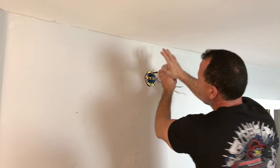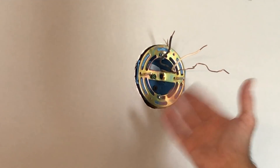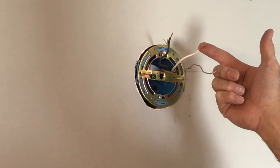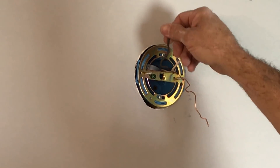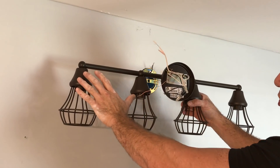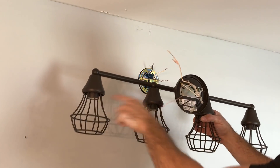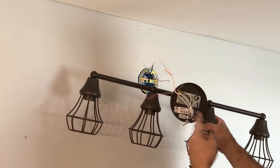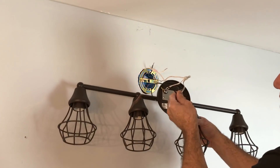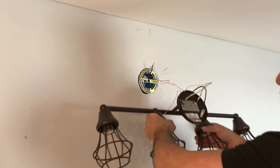Great thing about this screwdriver is I can hold that end and just run it in fast. This is super simple — you only have three wires to mess with. This is a single-pole switch, so you have a neutral which is white, you have a hot which is where your power comes from — that's black — and then you have a ground. Your fixture itself is made the same way: each one has a black wire and a white wire hooked to them, and they're all connected into a little harness. Your white has a little pigtail that goes on the white, and your black has a pigtail that goes on the black. And of course you have your ground, which is the bare wire. That's all we have to do — hook all of this up.